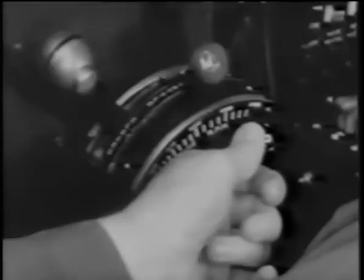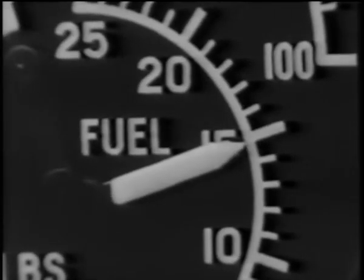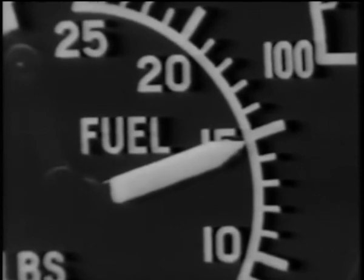Finally, to be sure that everything is in good order, there's a checklist provided on the instrument panel. Refer to it and go over everything once more. Are your fuel tanks full? Is the selector valve on reserve? Prop governor full forward and automatic rich on mixture? Fuel pressure up to 14 to 15 and a half pounds. Oil pressure up. Oil temperature okay. Coolant temperature okay. Suction up. And is your gearbox oil pressure okay?